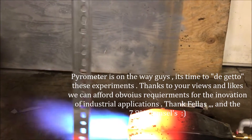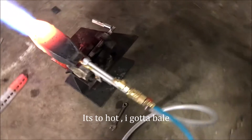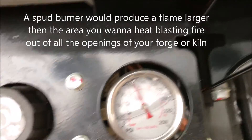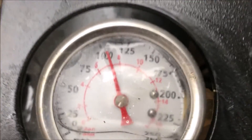Though it may appear we're losing all of our energy in the combustor, we are still issuing a jet blast of air that's right around 2100 degrees — just over the melting point of copper and just under the melting point of iron. You can't do that with a spud burner. This process is basically taking 100 psi of air and mixing it with the propane — but not inside the nozzle. We are not mixing propane and air inside a nozzle; you would need a complex regulator system for that.